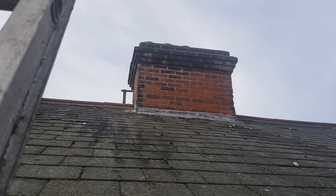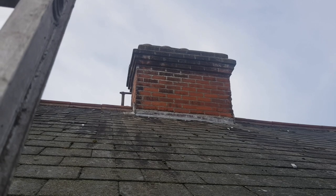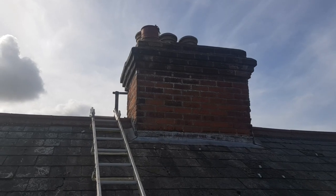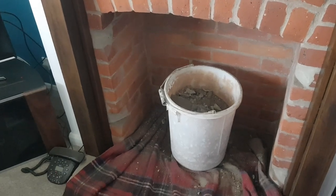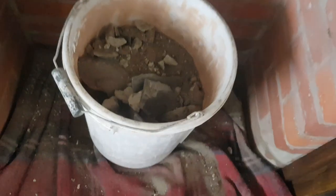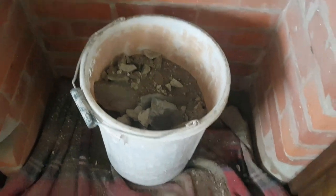Just got to go up there and get the pot on the left-hand side, number one. I couldn't get a roof ladder up just yet, but there we go — pot's on. Just a few bricks had to be replaced. Pot's on. Thank goodness whilst working on the chimney up top I did have the registry plate in place, and I plugged it with a bag, because I've got a whole bucket load of stuff come down — mainly from where I chipped off the top.